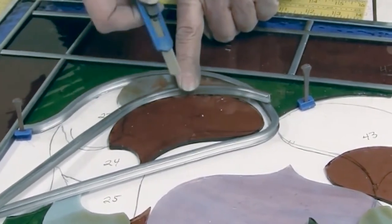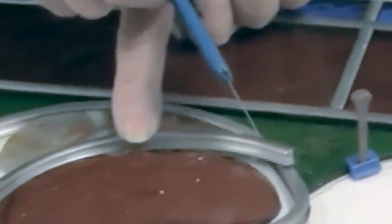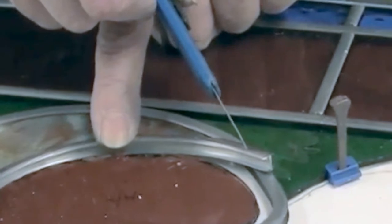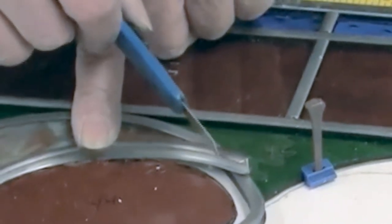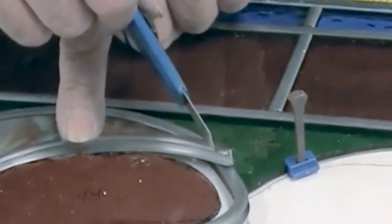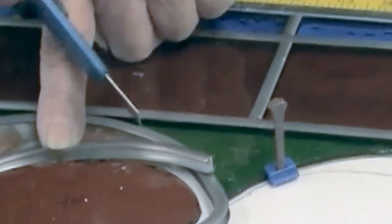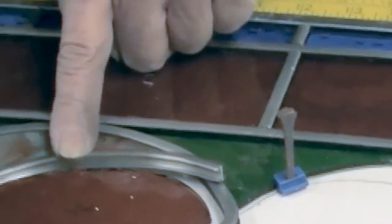You'll see that as soon as you put the lead solder on there. The solder only goes to where the lead is, and if it's a dead end, a square cut, that should be a sharp angle cut, you'll see that. So you need to put a line on there and cut it on the outside of your edge there. That's where the angle edge shear comes in.